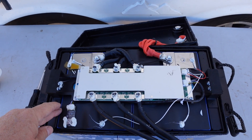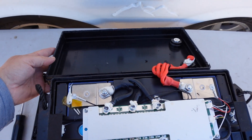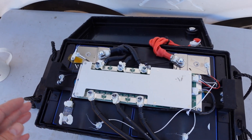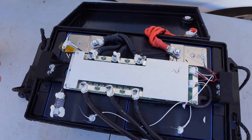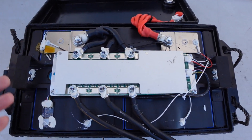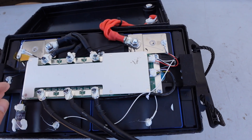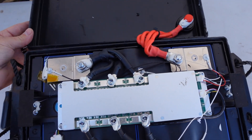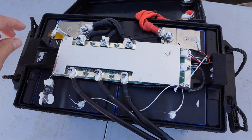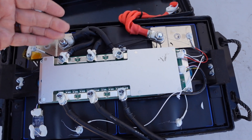The cells look pretty good. The one thing I'd like to see is a lid that could be taken off a little easier without trying to destroy the battery — mainly because if the company goes out of business in two years, this battery can last 10 to 20 years. If something goes wrong, you should be able to get the lid off to fix a bad connection or replace a failed BMS board while keeping your good cells. Once the lid is off, everything looks very serviceable — I like the metal frame and the quality wires and connectors.